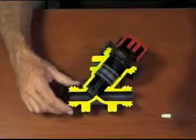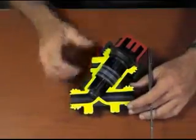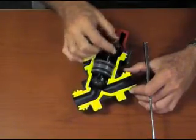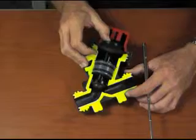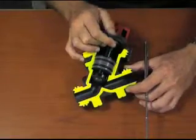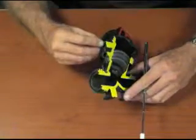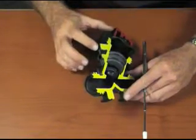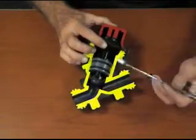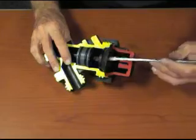Here we have the cutaway of the K530 series valve. Notice the different internals. It works similar to the other valve: if there's pressure on top of the valve it will close it; if you relieve the pressure, line pressure will open the valve. Or you have the option to open and close it both ways — useful if there's insufficient line pressure. The valve also has an option of spring-assist open, and you can put a spring on the top for spring-assist closed.